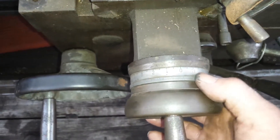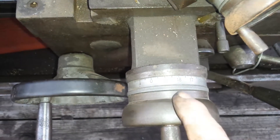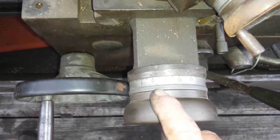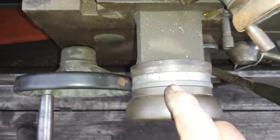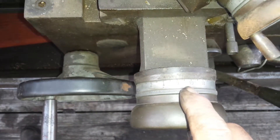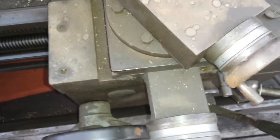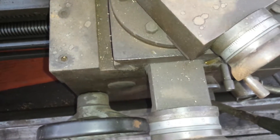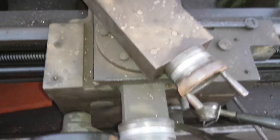If you can see this, one revolution is 200 thousandths — that's 190 right there. Anyway, this thing had all this slop, and if you move this, you can see the cross slide moving with just a little bit of movement. So it feels like it has zero or very little play right now.